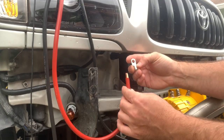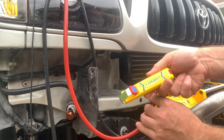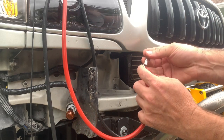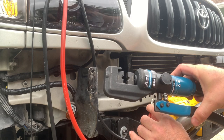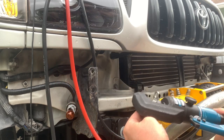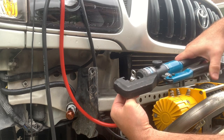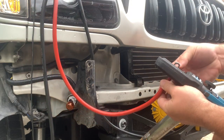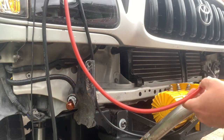If you don't know how to terminate new cables, here's how I did it: you need a wire stripper and new ring terminals for the ends — just slide them right on and crimp them down. I used a hydraulic crimper with different die sets. The die sets weren't quite the right size, so I would crimp the terminal one way, then twist it 90 degrees and crimp it the other way — that got them on nice and tight.